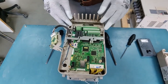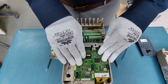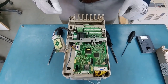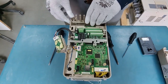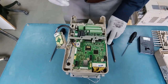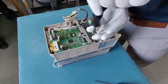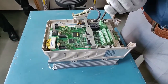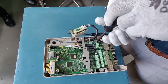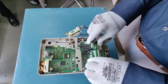So if this terminal board gets faulty or your control board gets faulty, we need to replace either of these. I am going to show you the simple procedure on how to do this. You can first simply remove this and we will use a driver to open it up, use this screw first and then go ahead with this one, and it can simply be pulled down.